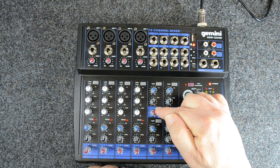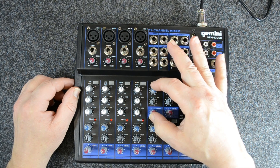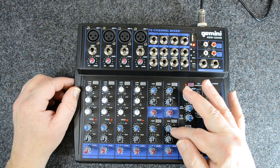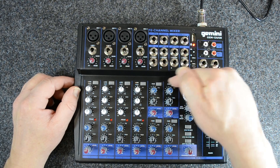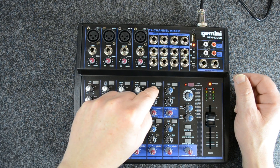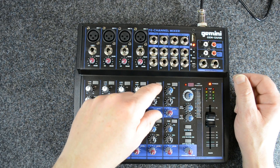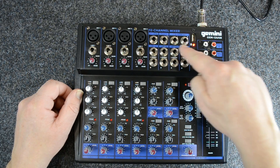Then we move over here. Because this is a 12-channel mixer, they group channels 5 and 6 here, then 7 and 8 here, 9 and 10, and 11 and 12. They do offer the ability to drop the signal by 10 dBs by pressing these buttons here, and they also give us the option to dial in effects on that particular input. We have balance control along with the burgundy knobs, which are your level controls. That repeats itself all the way through, covering all of these channels.